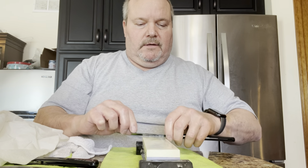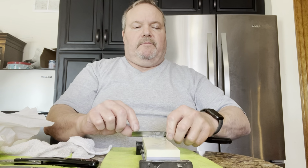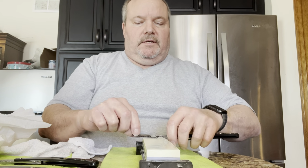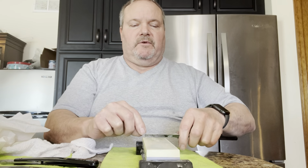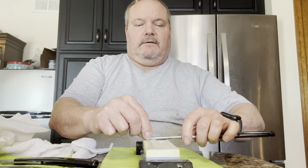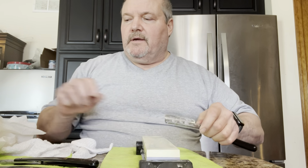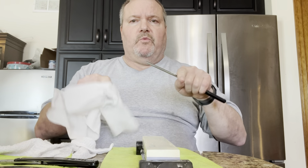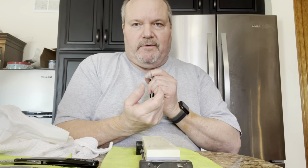This is where, as I said a lot of times, the heel of the razor needs a little bit more time specifically to be worked on. When you do this, sometimes you also need to make sure that the toe is getting some of the same. Mathematically, if you think about what they grind these Chinese razors on, I think it's called a hexa, the double wheel device with the grinder on it and the water squirting in, that the Europeans used to get hollow grinds, where they would put the blade in between these two wheels and have a lever that would pressure against them.